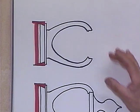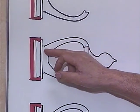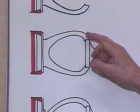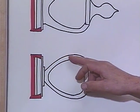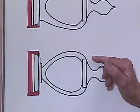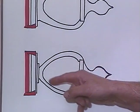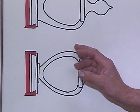Once that is achieved, we replace the lid here, and we need now to quicken the base area to create the full form of this piece. You can see on the last drawing that this has been achieved. We've quickened this base down considerably against this one here, and all that remains now is to sand the exterior to total conclusion, the interior to conclusion, apply whatever polish or finish that you have in mind.